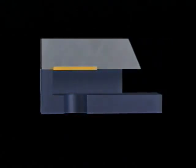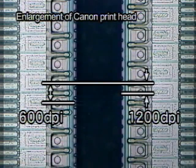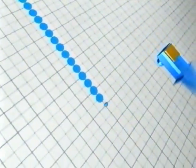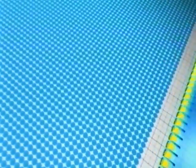The simple principle behind new microfine droplet technology permits utilization of semiconductor manufacturing processes for all steps, creating an integrated unit that requires no assembly, and significantly boosting the precision of the print nozzles. This structure and manufacturing method creates nozzles that are incomparably smaller than piezoelectric nozzles, making it easy to produce high-density multi-nozzle printheads. Because a single pass of the printhead produces high-density, highly accurate dot placement, new microfine droplet technology results in higher speed and higher quality printing compared to piezoelectric printers.